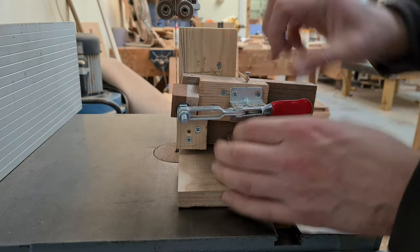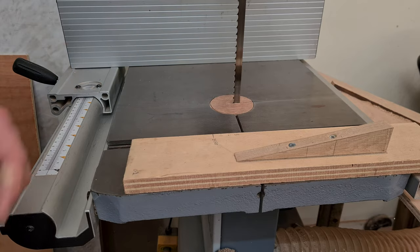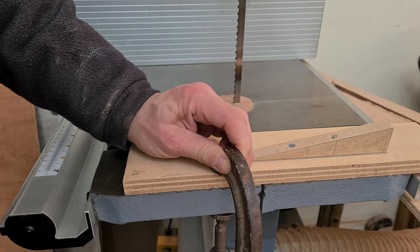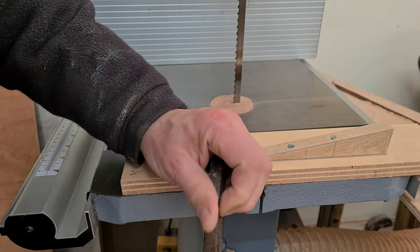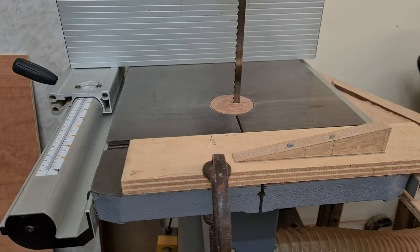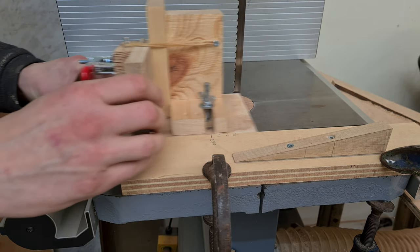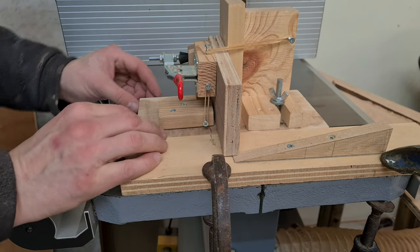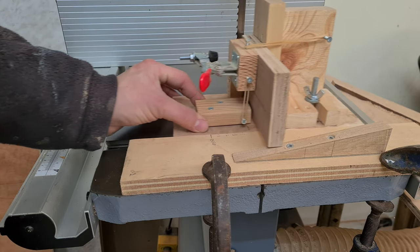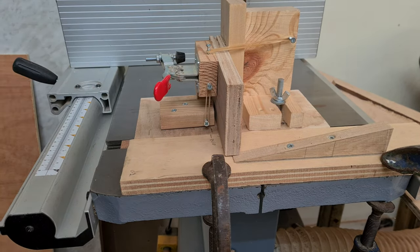However, in a segmented helix, the top and bottom surfaces must be angled to match the desired helical angle. I achieve this using a straight ramp. The ultra mega important point here is that the helical angle of each segment changes from the outside to the inside of the ring. If you cut these surfaces with a bevel or compound cut, they will not produce a seamless segmented helix. You can give it a go, but you'll only get fairly close if the diameter is large — otherwise you'll need to vary that helical angle on the top and bottom surface of each segment.